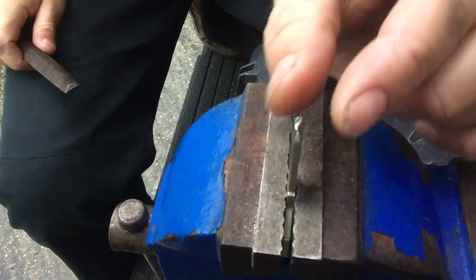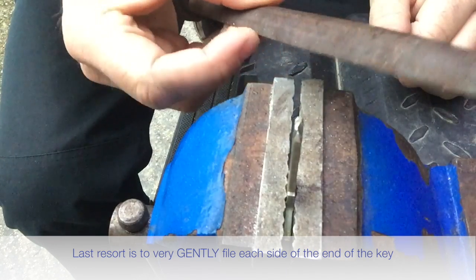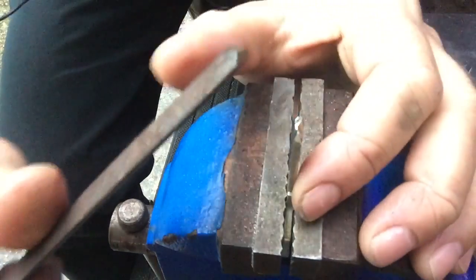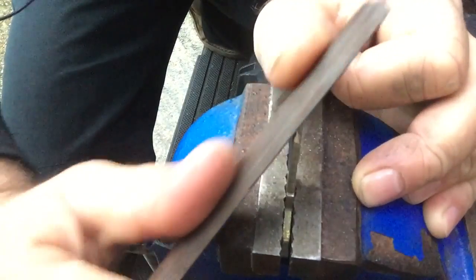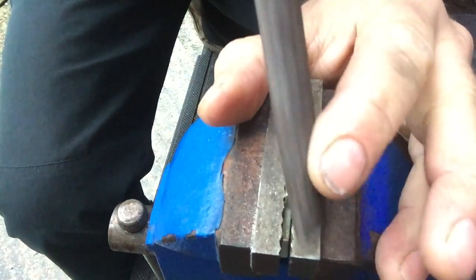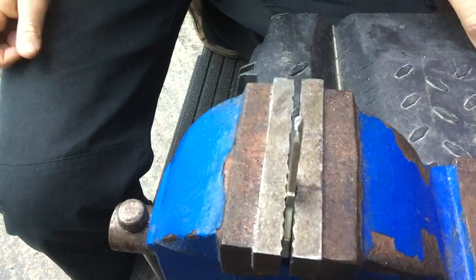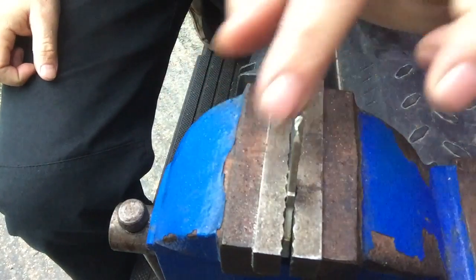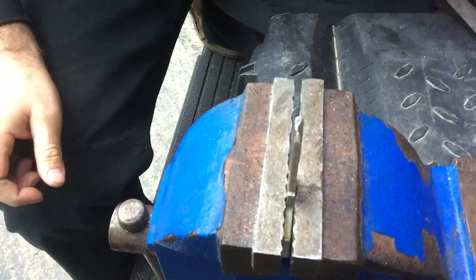If you really don't have access to a spare key and you can see the head of the key is a little bit worn, you can take a fine file — something that's not too coarse — and rub it very lightly over the two sides, following the direction the key was originally filed in. Apply only a very small amount of filing; start small, you can always do a little bit more. Don't apply too much pressure or get carried away, because you can see how much debris comes off even with a small amount.